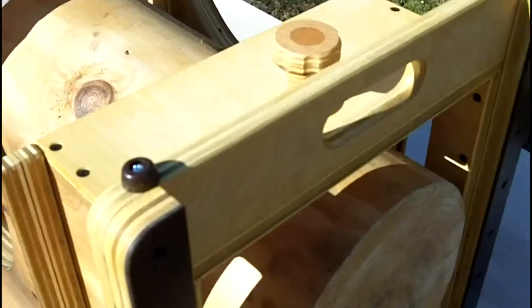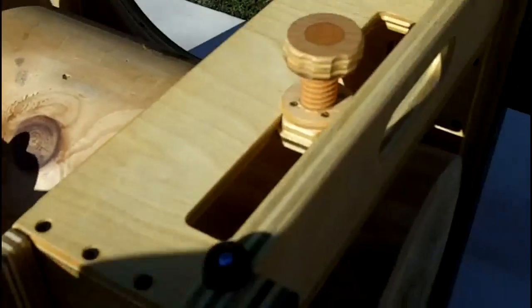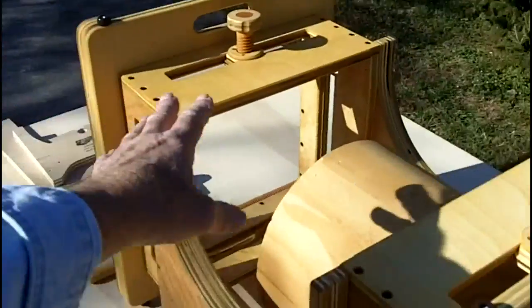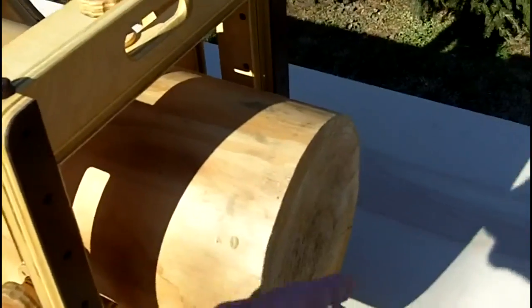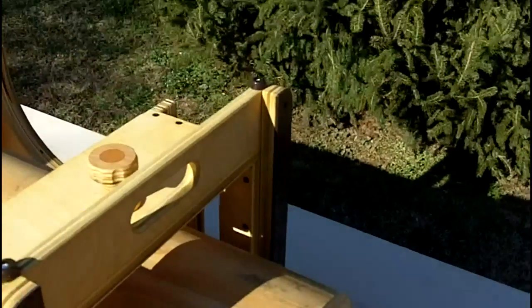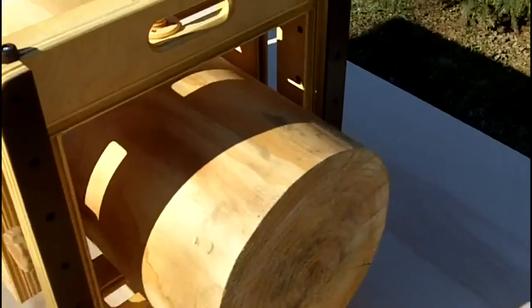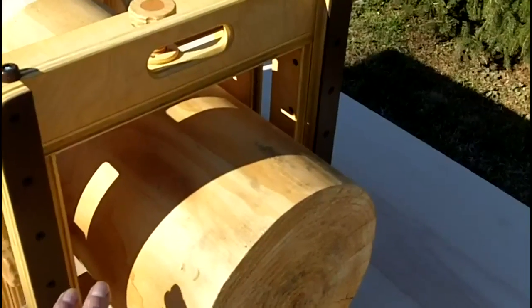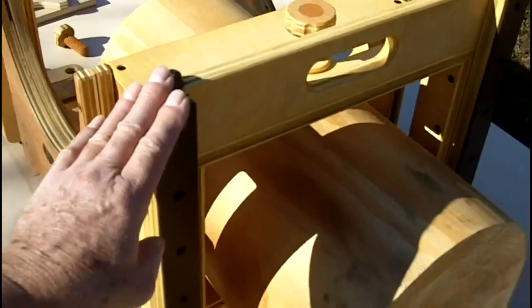If you wanted to extend the distance between the end of the log and the notch, let's say this was a whole log that continues off the end of the jig here, and we're going to put the notch here, but we've already end trimmed, and we've now brought the joist or even a regular wall log, if we're going to do a coping out of a corner notched assembly. We want extra log hanging out here. In the case of the company where this jig is going, their standard setback is much more than my 14-inch standard on this jig.